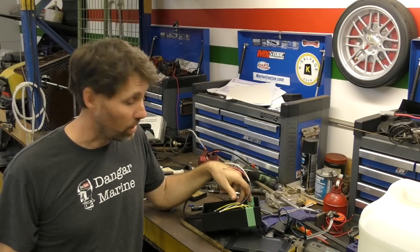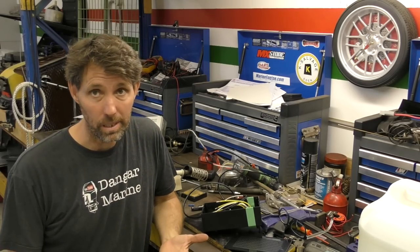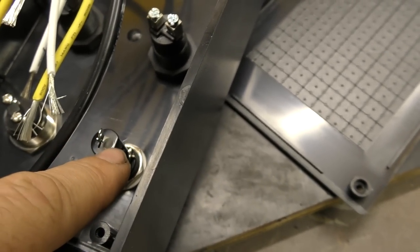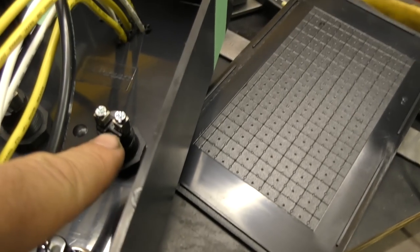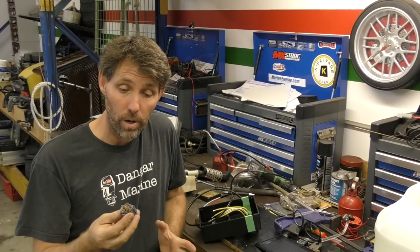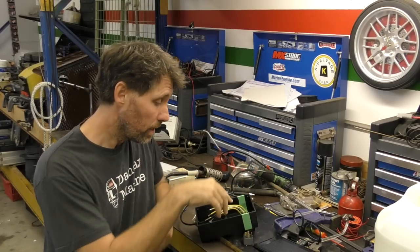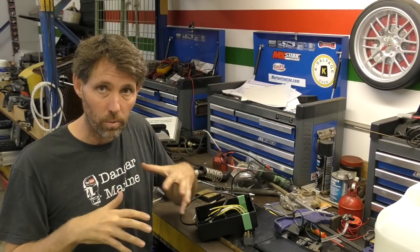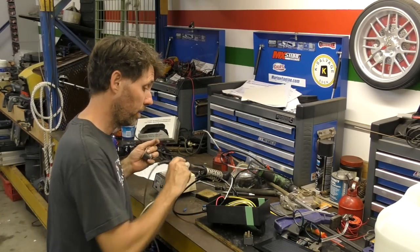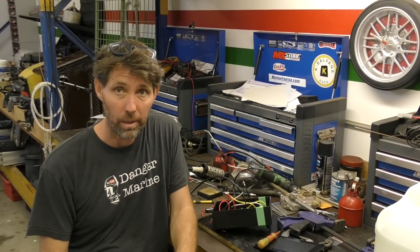The next bit isn't really rocket science. All I'm going to do is connect all these wires up in the same way as the circuit diagram on the chalkboard, and then we can start testing it. This fuse holder I'm going to solder rather than putting spade connectors on it, but every other connector has just got a little grub screw we can screw down on — so it's going to be pretty straightforward. To make sure I get the wires in the right place, I'm going to take a relay, hold it upside down as though it was in the socket, and read the numbers off the back to make sure I'm putting the right wires to the right places. When it's all finished I'll show you what I've done.